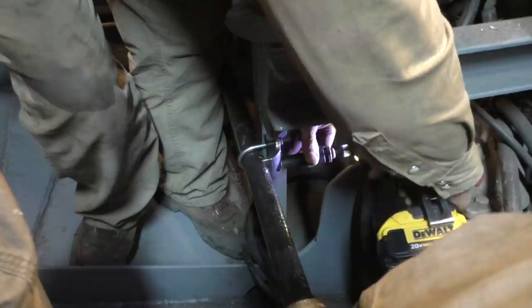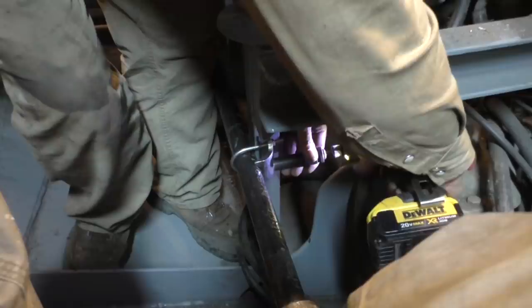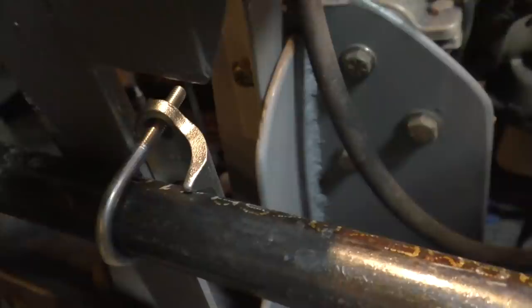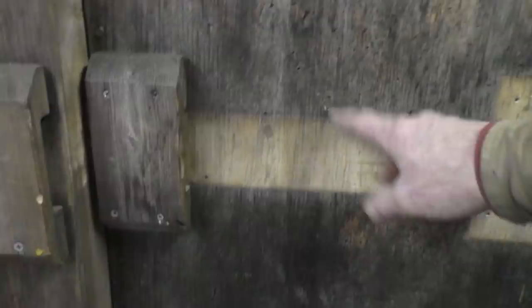Right angle clamps for electrical conduit - why the hell are we using them on hydraulic? They look galvanized. Check that out - no drilling holes, it pinches itself down. The U goes over the pipe and this piece just clamps onto whatever plate of steel is around, which is angle iron in this case. Beautiful little deal and they cost about five bucks a piece.